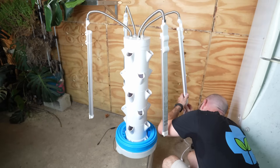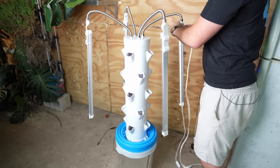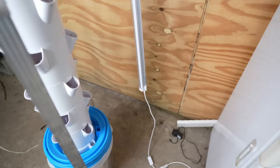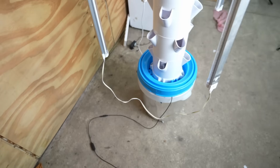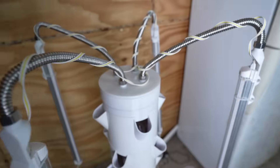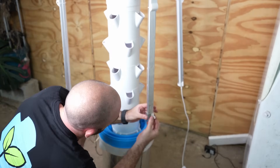I'm wiring this into the base of the one closest to the power point, then daisy chaining from there. Once wired up they won't be unsafe except for the one exposed element at the end. We run from the electrical cord up to the light, daisy chain around our fixtures to the next light, then up the light and over the top to where it terminates. At the bottom of that termination the pins are exposed, so I'm going to cover that up with electrical tape over the end of the light fixture.